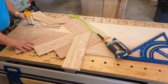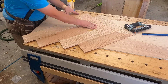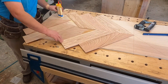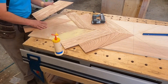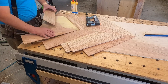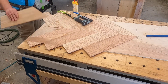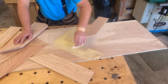It's just glue, nail, glue, nail, glue, nail and then testing that fit. What I'm doing here is correcting for human error. You're dealing with wood — it moves. We're not dealing with tenths of thousandths of an inch, so every once in a while you'll see me go over to the saw and make just a small tweak on the angle. One of the boards I had to rip down just a hair's breadth to get it right. That little fine-tuning really sets these apart because you don't want any gaps at all, and it's really easy to get gaps on a table like this with so many different angles going so many different ways.